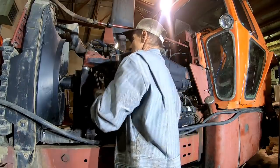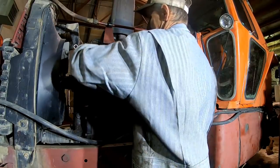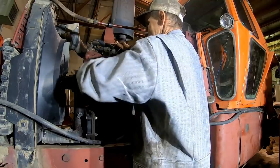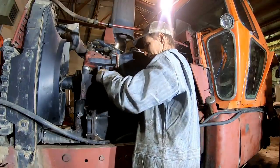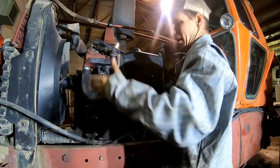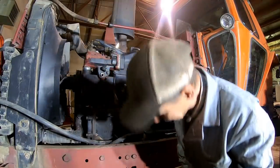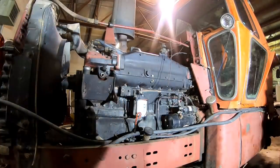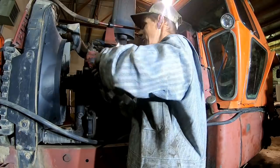Anyways, I went out there this morning. It's 7320. Had an engine stoplight on and all that kind of stuff when you started it, because it was just running off the mechanical, you know, the VP44 was the one pulling the fuel in. The electric one, I went over there with my hand and slapped the electric lift pump, and you could hear it try to kick on and it wouldn't run. They've got one over at their shop, so I jumped in my service truck, came back over here and got one from their mechanic, and went back out there and stuck it on.